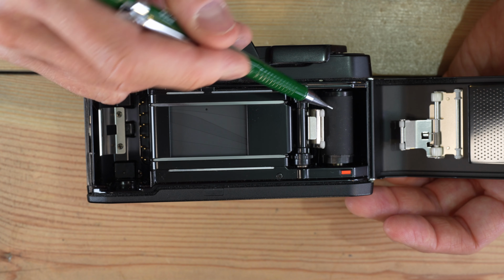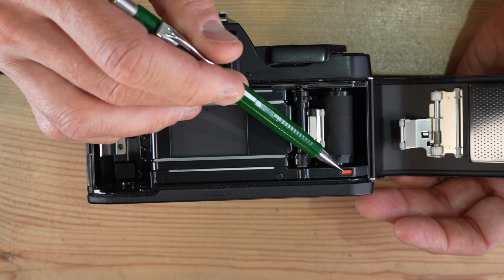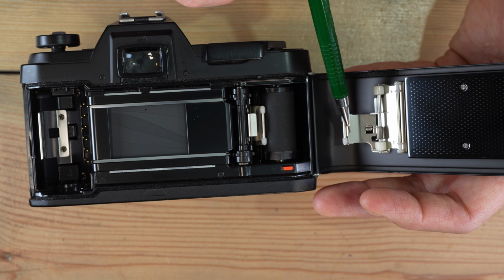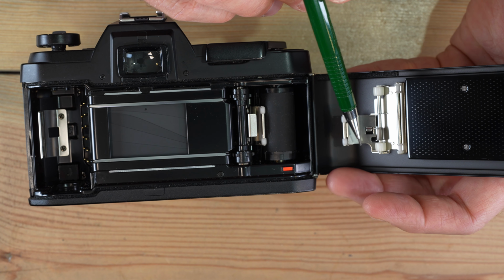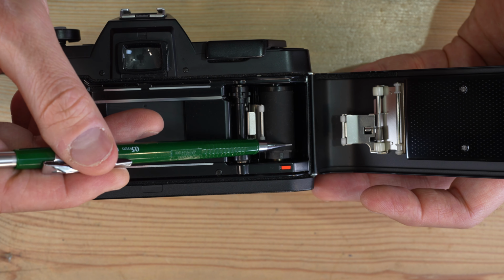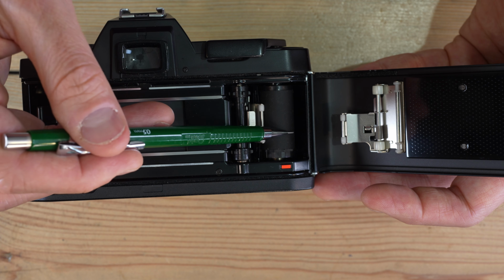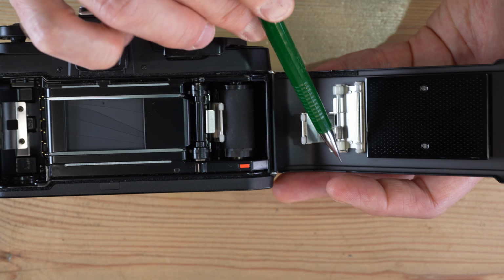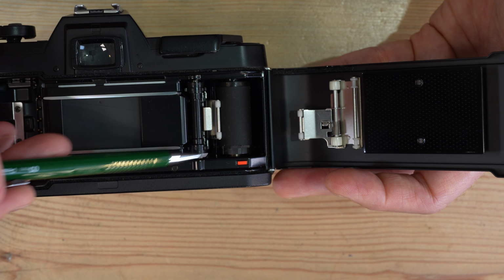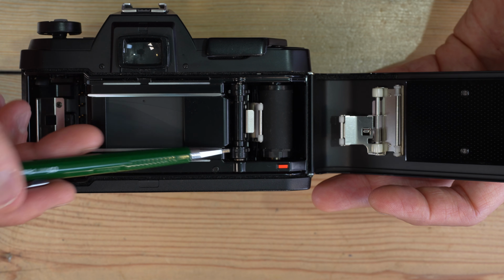This is the film take-up spool right here, and what you do, as we'll show you in the second video, is set your film leader down here at the film leader placement index, and then this will take up your film. This is like a multiple use gizmo right here. This little lever presses down here to put pressure on your film so that this rubberized grip will pull your film through the camera along with this sprocket here. And then these 2 rollers rest here and here so that they put pressure on the film sprocket so that it engages well with the sprocket holes on your film.